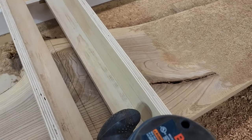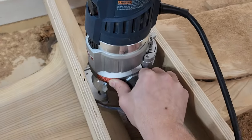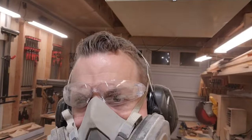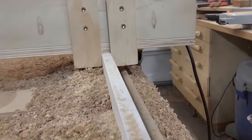It can also be a bit tough to move the sled for each pass depending on how heavy your router is. The cuts are usually across the grain because your sled length is limited — this is usually fine but it can cause small tears in the grain and be harder to sand out. The biggest challenge however is dust collection. The DIY router sled has no dust collection so when I flatten a slab it makes a huge mess and covers everything in my shop with chips and dust. It's not a perfect solution but the DIY router sled does get the job done.